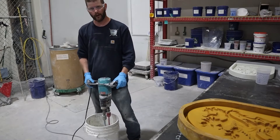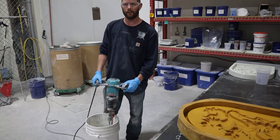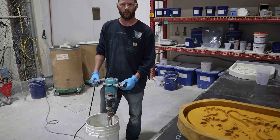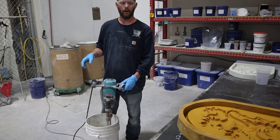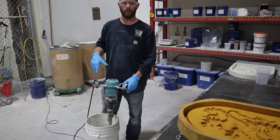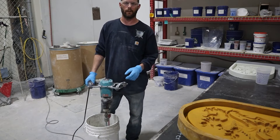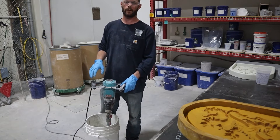I've let this ice melt a little bit. This seems really low absorption — honestly, if we're not running ice, we'll even skip fall sets just because the sand doesn't absorb much water. One thing I will point out: you notice I put the fiber in at the beginning. The reason for that is this is more of a dispersing fiber — we aren't using the bundled fibers on this. So if you're using a dispersing fiber, you want it in at the beginning of your mix.